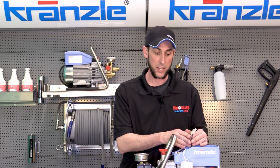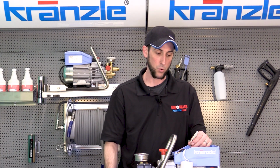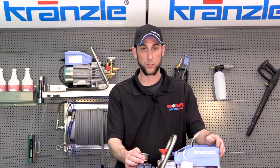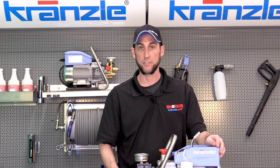And like I said, you're gonna look for any evidence of water inside the machine or loose wires. If the machine's getting dropped a lot or left in conditions where it can get water inside the enclosure, we may start to see the GFI trip out of the blue.